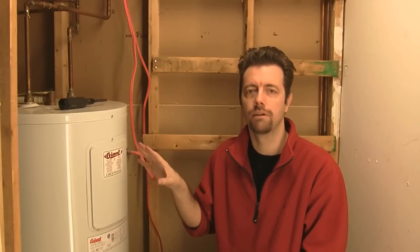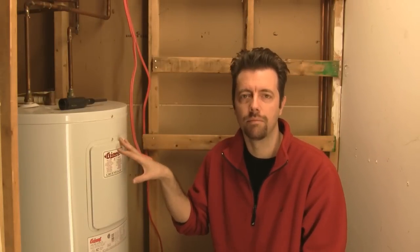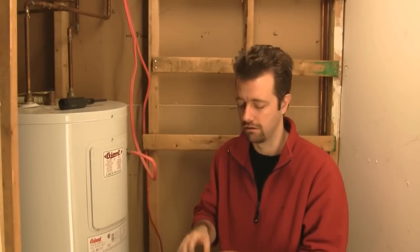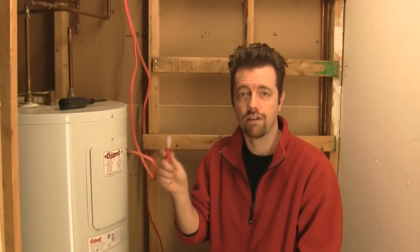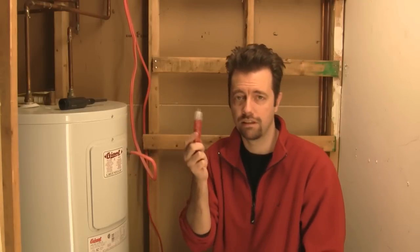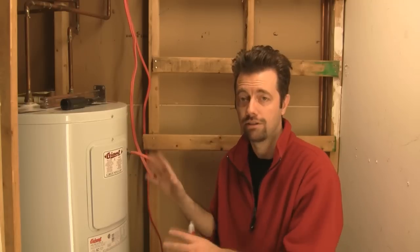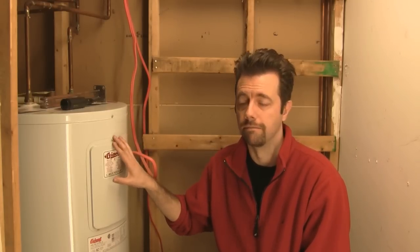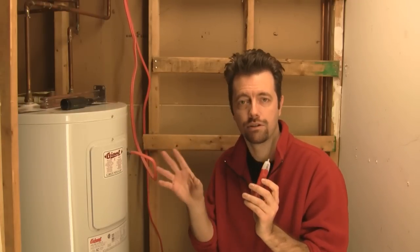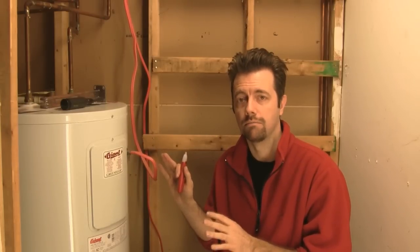This repair is a little trickier than most only because we're dealing with electricity and plumbing in the same appliance, so I'm going to make extra sure that the electrical is turned off on this tank before we continue. I'm going to use an electrical tester to make sure the electricity is off once I've turned off the breakers. You can pick these up at your local home store for about $15. If you turn on an electric hot water tank while it's empty the elements will burn themselves out, so you need to be careful that the power is totally off — plus you don't want to get electrocuted while you're dealing with water and electricity. If you happen to have steel braid around your wire these testers won't work; they can't penetrate the steel, so be extra certain that the power is off before you continue.